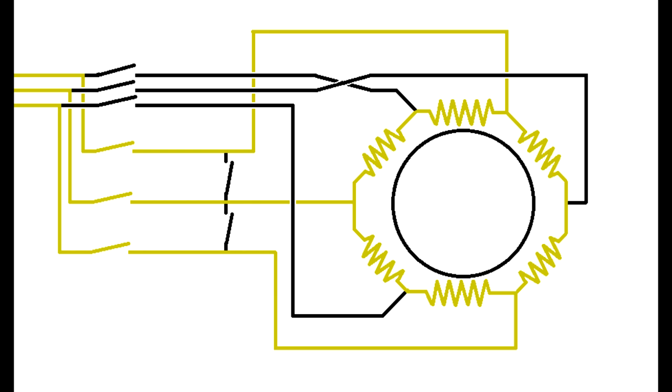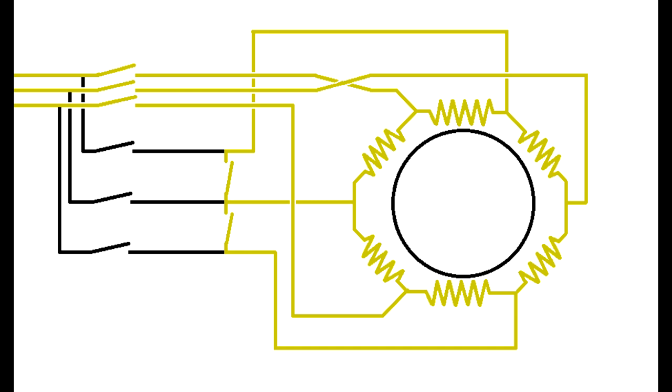Now, this is a very important concept to understand for pole changer motors. On all three speeds, leveling, medium, and full speed, we're always applying full voltage. So when we want the motor to go slow, we want it to go slower but with full power. So we want it to be speed limited. We still want that full power to be there because of the load. We don't know how much load we've got on the motor, so that full power must bring it up to even medium speed. So that means we always need that full power to get it going, even to a slow speed. So whether it's leveling, medium or fast speed, we're always running the motor at full voltage. So we can't do star delta. We can't put resistors in the way. So we have to use the six phase characteristic of getting the two different frequencies out of it, which is the purpose of the whole thing.